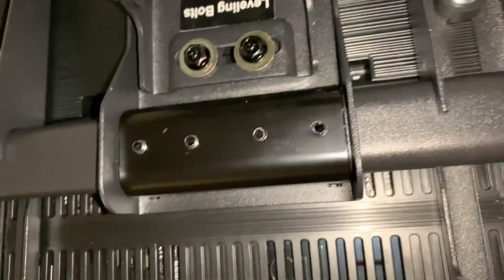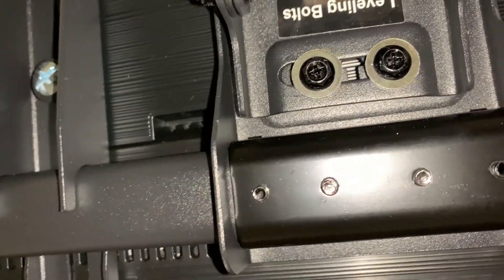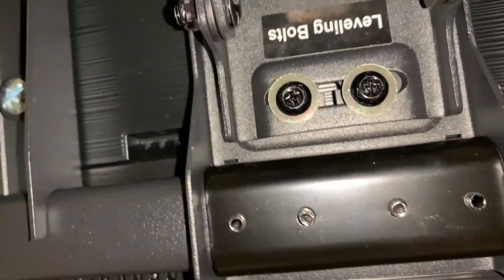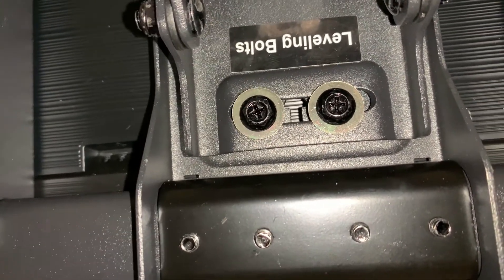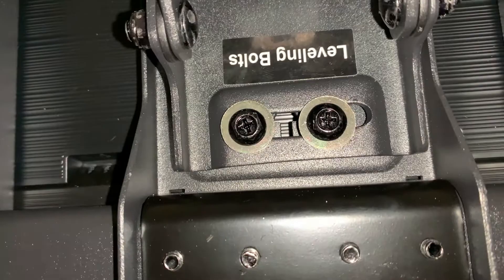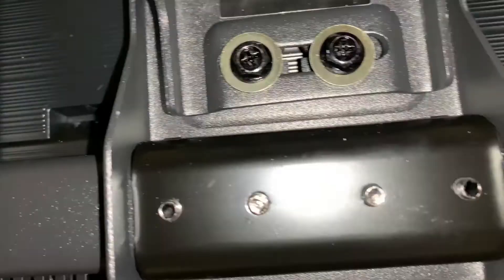Basically, I just picked it up, hooked it on the top. My screws aren't in the back yet, so the next thing I'm going to do is get my screws in the back of there so my TV doesn't fall off the wall when I'm moving it around. My screws are tight in the back and that's a swivel point, so I want to tighten them enough that I can still move the TV fairly easily but it doesn't just fall over — snug but not super tight. That way when you push and pull the TV, if you need to adjust the left and right a little bit, you can.